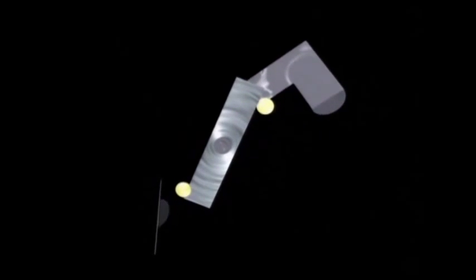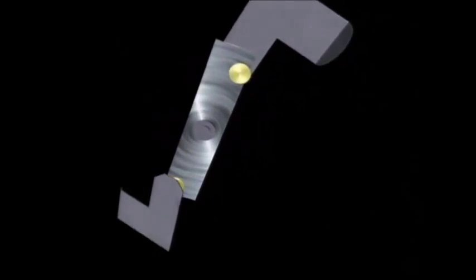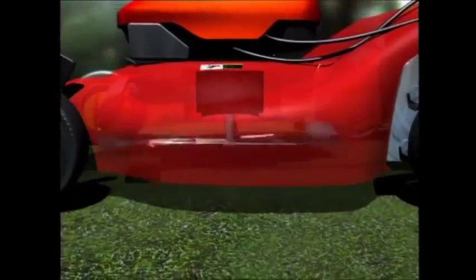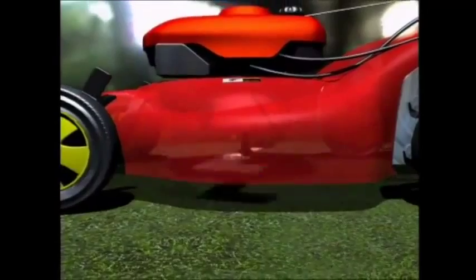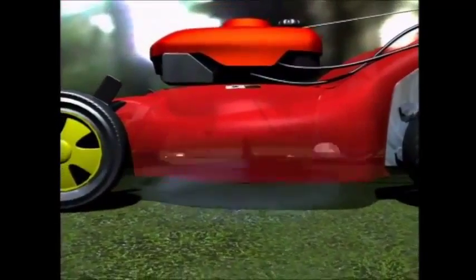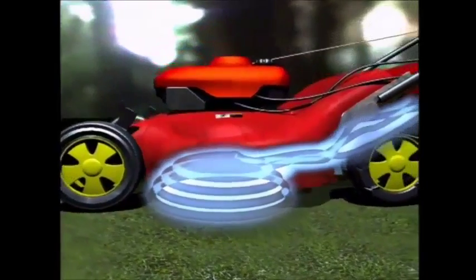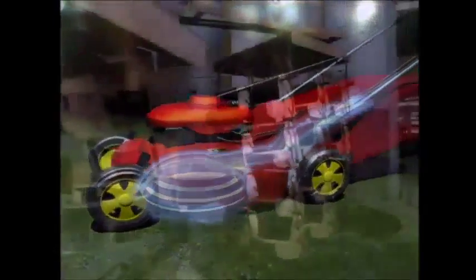Each of the blades is bent to include a 36 degree angle of wing. It actually makes the grass take off — which sounds amazing, but it's true. Each mower has two blades screwed onto a central pivot. This spins at 2800 revolutions per minute, and this is where the wing comes in. The angle pressed into it creates a low pressure area beneath it as it spins. This sucks up the cuttings, which are spun around until they pass through the only exit route available to the collection tray. The job's done.